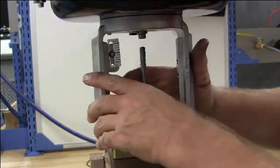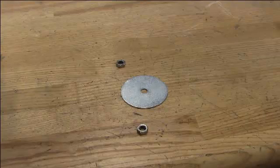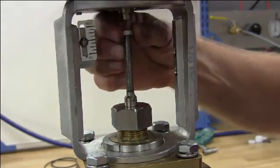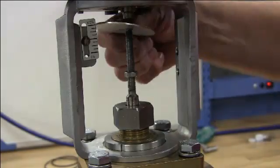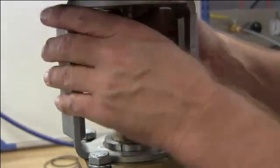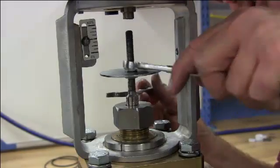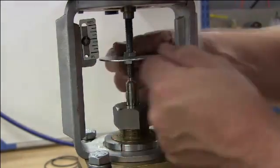Be sure it's not too tight — you should still be able to move your stem up and down. Now on the stem, place a jam nut, travel indicator washer, and then our second jam nut. Bring the first jam nut down the stem, travel indicator washer, and second jam nut. Using your wrenches, tighten both jam nuts together. Pull up on the plug and tighten into the actuator stem.